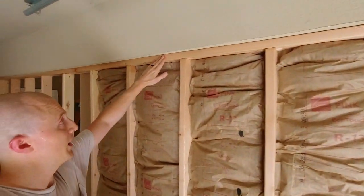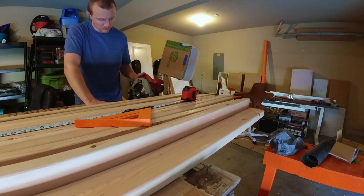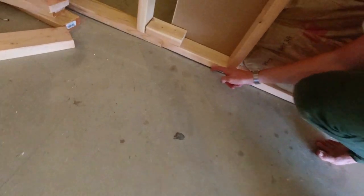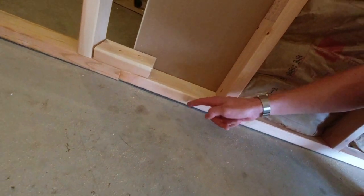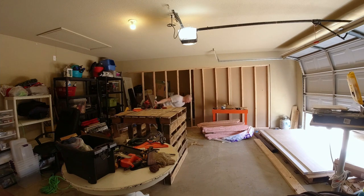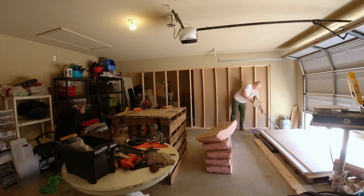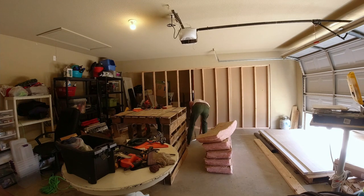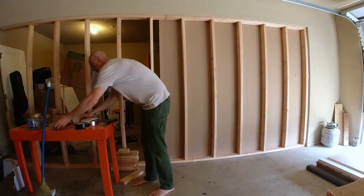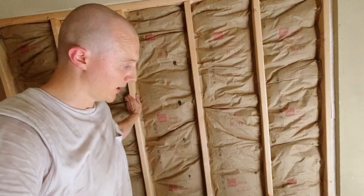This main 2x4 up at the top I just drilled into the ceiling. The 2x4 on the bottom has rubber under it, and then with each of the studs the 2x4 is going vertically. I basically pressure fit them in there, wedged them in and had to hit them with a hammer to get them standing nice and straight. It pushes up on the ceiling and then down on the ground, and as you can tell, the whole wall with the cumulative pressure of all these studs against the ground — it's solid.